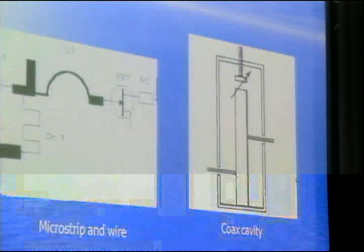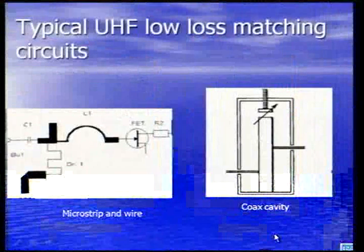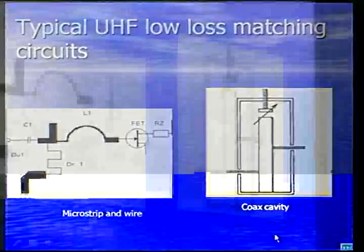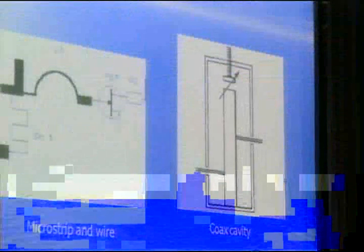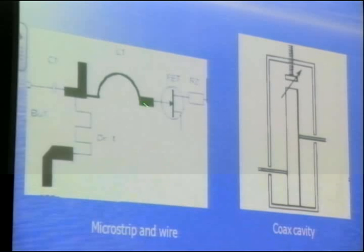The simplest matching network for VHF consists of a parallel resonant circuit L1 and a capacitor, with a capacitor tapping the antenna into the top of the resonant circuit — or equivalently an ohmic tap onto the coil — allowing more flexibility in setting the match. For UHF we use a coaxial cavity or troughline cavity with the FET connected and a series capacitor option giving a nice high Q. Microstrip plus wire — the DJ9BV preamplifier is probably the best known — is suitable for 23 centimetres and up.